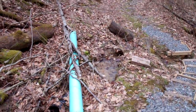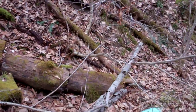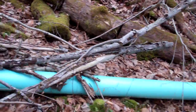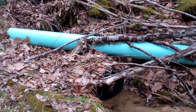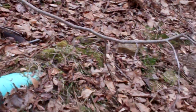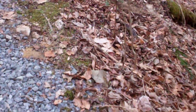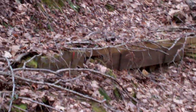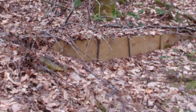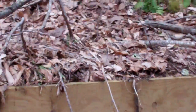Here's another spot where there's a dip with water running in it, so I put it in a 6-inch sleeve. I thought I'd backfill this, and someday I might, but since I haven't had any freeze issues we're staying where it is. This is really good soil for growing big rocks, which is one reason I didn't think I'd ever bury it — but I did. Stability also, so your pipe's not moving around and maybe getting a crack.